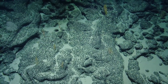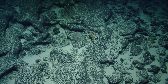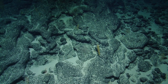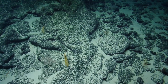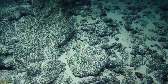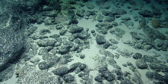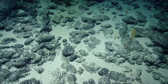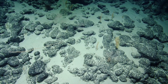I suppose we should describe what an elevator is, because we don't really use them on this ship. It's pretty simple: a platform with things sticking up in the middle that has some flotation and some communications and tracking on it. You can put some heavy stuff on this platform, like an experiment you want to deploy on the seafloor or a large pump you want to use for a while, and you let it free fall to the ocean floor. Sometimes you reposition it with an ROV or an HOV to where you want it. When you're done, you can either acoustically or manually release weights from the bottom so that it floats back up and the ship picks it up. It's pretty common to use with an ROV when you have really long dives.